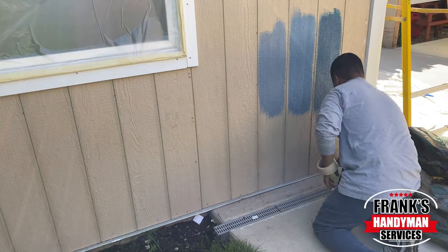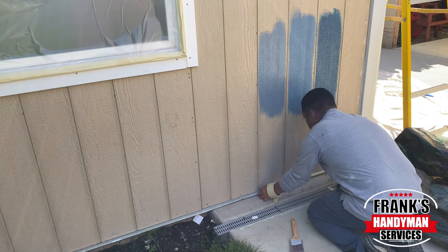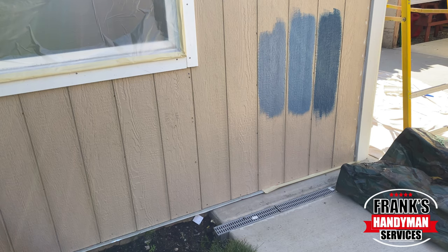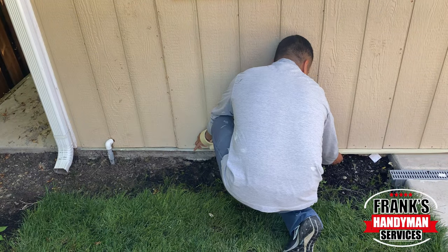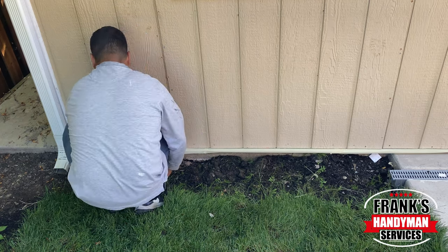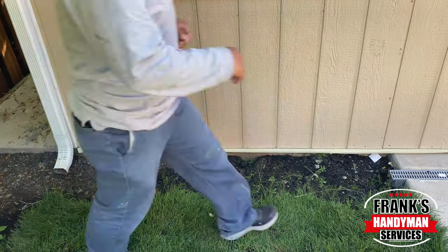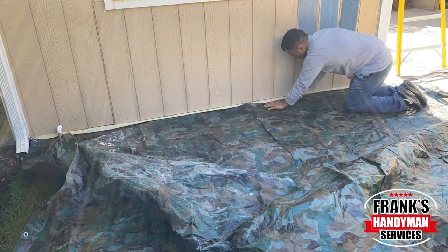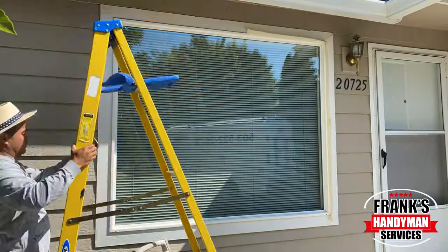Right here I'm gonna cover the floor. I'm brushing it right there, getting rid of any dust or dirt, so the tape can adhere to the flashing. I'm just taping it all along the flashing, going from one end all the way to the other. Then I have a plastic — I had one extra laying around — so I'm putting it right underneath the tape and taping the edge so it holds it in place.